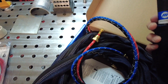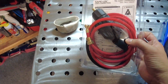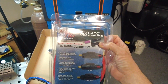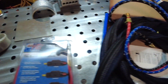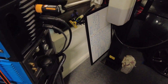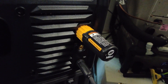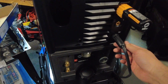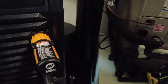So the red line is our primary power along with hot water coming out of the torch. The three lines connect inside this adapter and we're going to connect it all to this new adapter here. Miller says it would void the warranty if you use this, so obviously take caution and do it at your own risk. The first thing we do is take out the main cable — the 25-millimeter DIN for the torch — and set that aside.